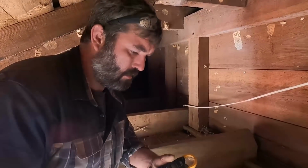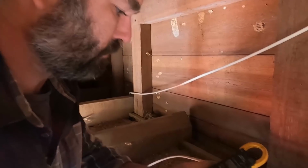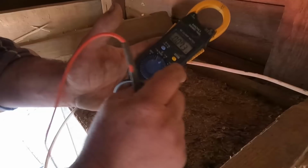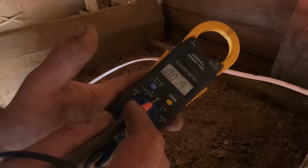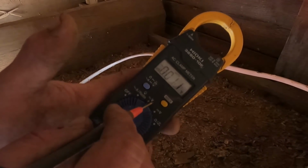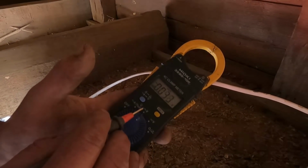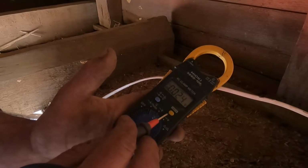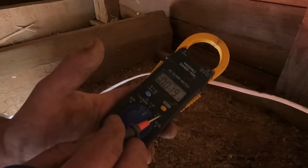All right, guys, so here's where I was telling y'all, we saw it's actually not through both sets of insulation. So on this wire, there's an outer insulation, inner insulation. Now this should go, I had Robert check when the light goes off, so I've got my multimeter. All of them are a little bit different, but if you're working on an old house, any multimeter from anywhere, this little squiggly line right here with a V, that's going to be your AC, your alternating current volts. So anytime you're checking anything on a house, it's going to be the squiggly line. If you're trying to check power on a car, it's going to be a straight line and a dotted line. That's going to be your DC, your direct current.